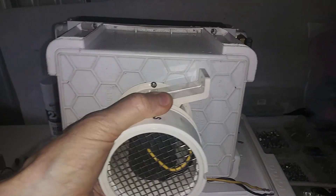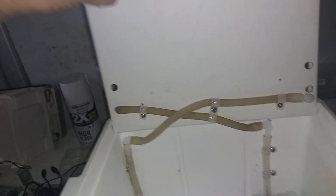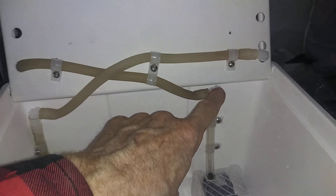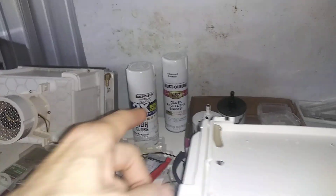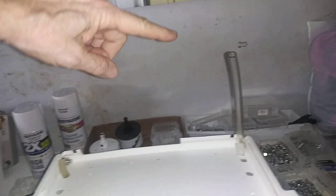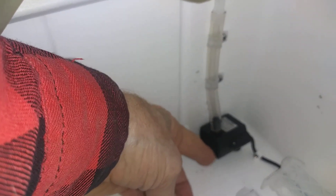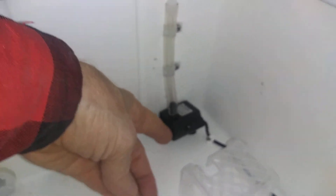When you put this on top of the unit, the inlet is over here and the return is over here. The water pump is here — it goes up, crosses over, and goes up to that bottom brass fitting which is directly under the tank. It then goes through the heater core, fills it up to the top, then returns through this 90-degree fitting back into the drain, crosses over to this side, and drains down. I control the speed with this pump, which has a dial you can turn left or right to make it faster or slower.